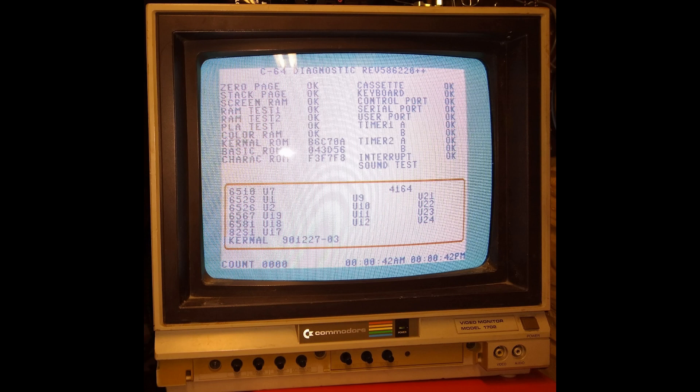It sounds like a good test for the SID too, so we're in good shape. What did we learn? Apart from the computer itself being fine, we need to make sure our connectors are clean. We also need to ask ourselves whether the test results make sense — analyze them, don't just take them on blind faith. I could have desoldered those two chips, bought replacements, and thrown away two perfectly good CIAs if I hadn't stopped to think about whether the results made sense. Let's use the diagnostic tools we have, but let's not forget that the best diagnostic tool is the one we already have — the big squishy thing between our ears. Thanks for watching and I'll see you in the next one.